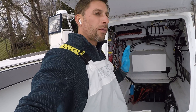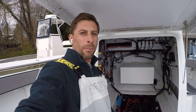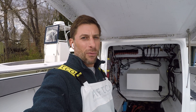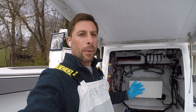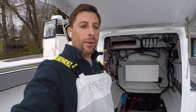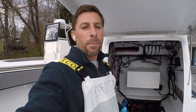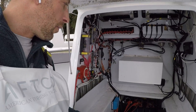What I want to do is switch over to my house batteries. The reason being is I have these giant livewells in this boat — 200 gallon livewell capacity — and I have the big Rule tournament 1600 gallon per hour pumps. They draw a lot of amp hours, I think like 4 or 5 amps. That, combined with the two Humminbird Apex 16s, means I'm pulling a lot of juice out of the batteries. I was getting a lot of low voltage alarms very quickly, burning through lead acid batteries really fast. So I wanted to try the lithium batteries.